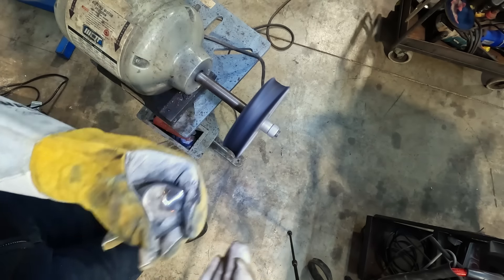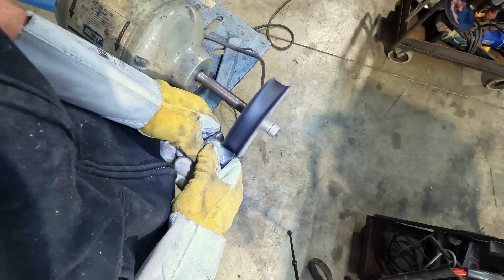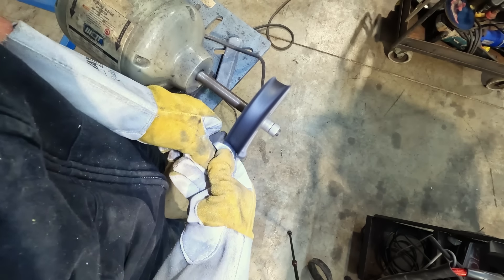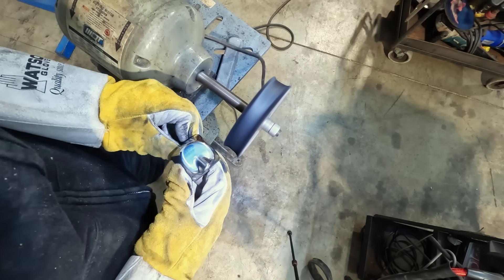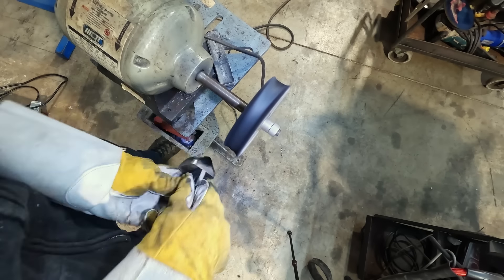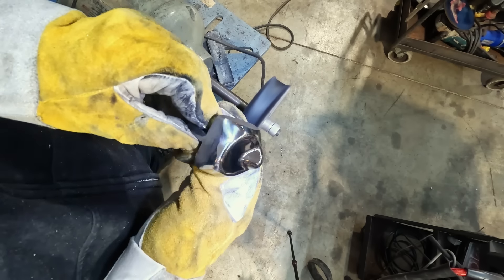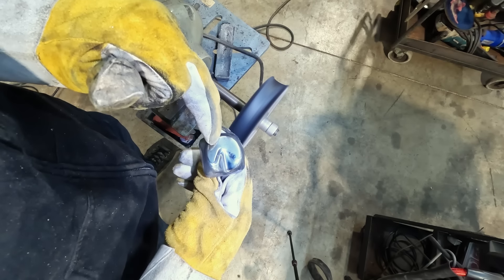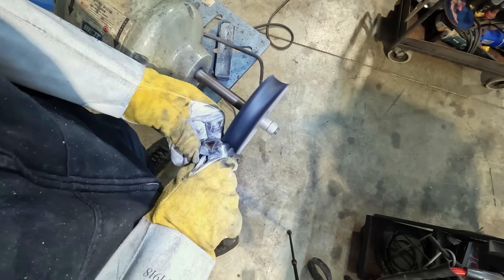This is only 600 grit, but being mild steel there are a couple of marks still in it — but 100% good enough as we say. Not perfect, but pretty cool that that used to be just a bunch of plates. If you're doing all the polishing yourself before going to a chrome shop, that's where you spend all your money — so if you prep and polish your stuff you're really going to save a lot.